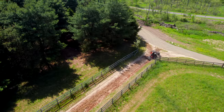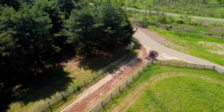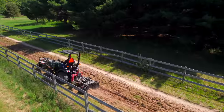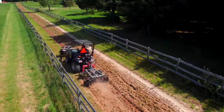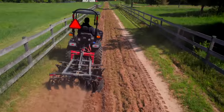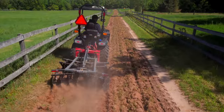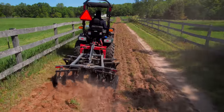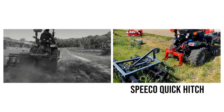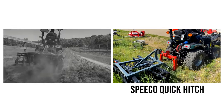You need a rear hydraulic remote, all right? The Summit tractor comes standard with a rear remote. One of the things that sets it apart from most other tractors on the market. But having that there allows you to put this top link on there. And so you're gonna see, not just in this video, but other videos I've done, but even the process of hooking up to the attachment, you don't have to get off the operator seat. I just adjust that hydraulic top link in or out a little bit to get the hooks right where I need them to.